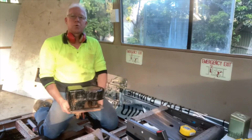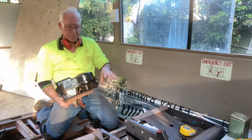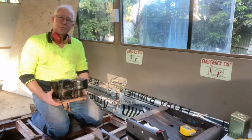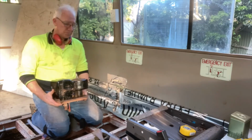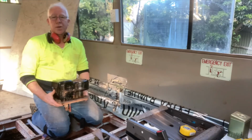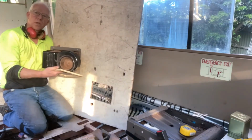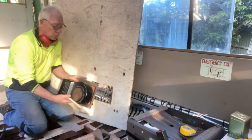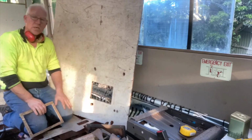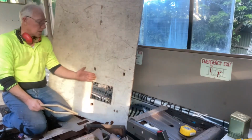So I'm working on putting the heaters back on in the bus. We were going to put them under the seats, but only one will fit. So basically that involves clamping off the hoses so that we don't lose any radiator fluid, putting the floor down, making the connections and passing the hoses back up through the hole. The heater's got a drip tray under it, which is recessed into the floor. Where we were able to put the seat mountings was between two frames, and that area is a little bit narrow, which means that I have to raise the heater a little bit.